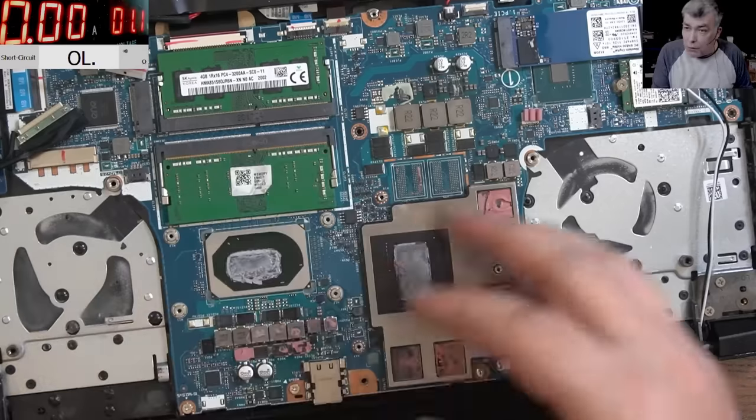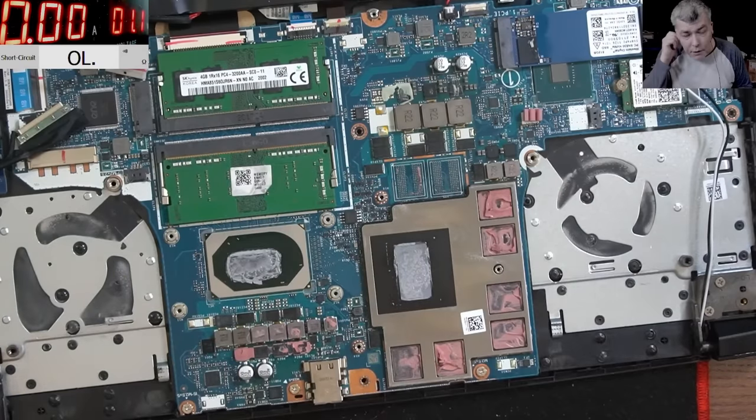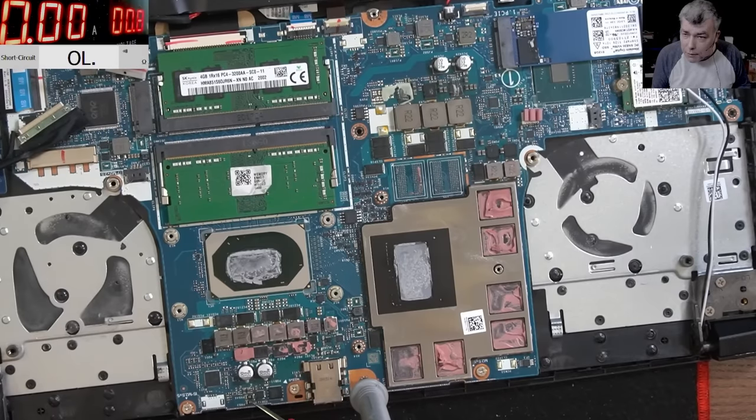So the lowest voltage on this board, it's actually the CPU voltage, which is around 0.8, yeah. So let's come with 0.8. We cannot burn anything, yeah, with 0.8 volts. Let's set up a current limit, about 1 amp. And let's come with the voltage with the power supply exactly here on those resistors, yeah?